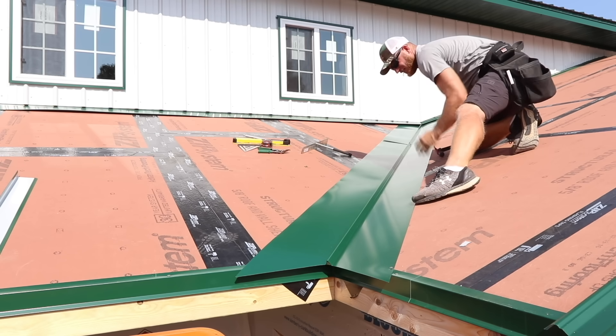Don't forget to make sure you properly lay out top and bottom to the specified dimension of your steel. For us that's three feet, so we want to make sure every sheet is laid out to a three-foot dimension so we don't get off and we can maintain a perfect square and a perfect straight line down at your eave.